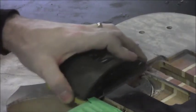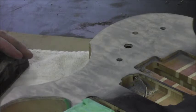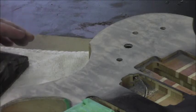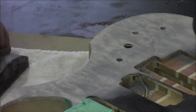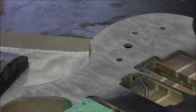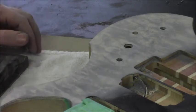We are going to do a few coats of this — after we get it all sanded down we're going to coat it again with the black. Usually I do two or three coats, because I want to make sure this end grain is taking on as much black as possible. That's if I want a really stark contrast — a red flowing right into black. If you want a bit of a lower contrast, instead of using black you can mix like a gray, or a darker version of whatever color you're going to do for your final color. There are different things you can do to get different effects.